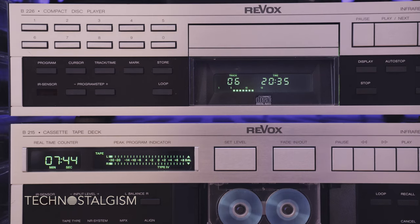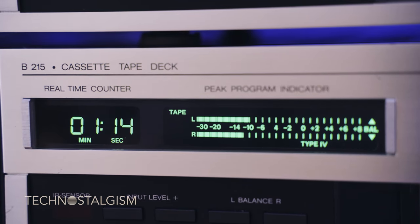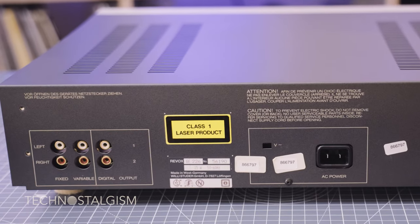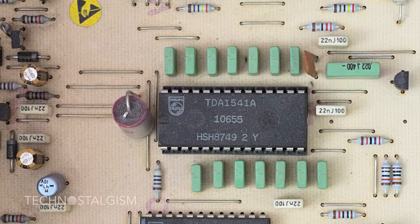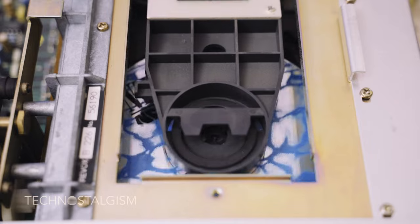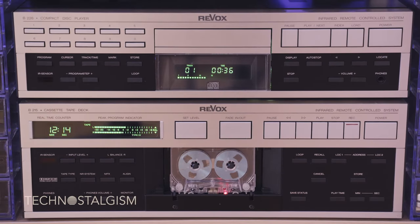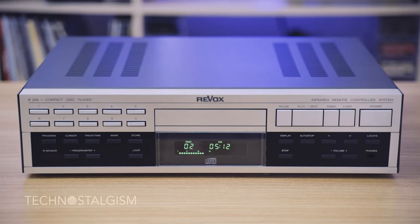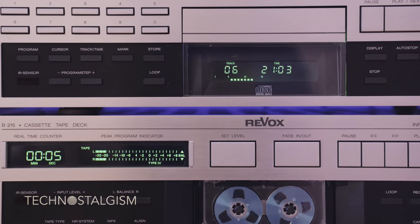And yes, there will be a video about replacing that one as well — make sure you're subscribed and hit that bell icon if you'd like to be notified when it's out. I really love this Revox CD player and use it as my main transport connected over S/PDIF coaxial. The fixed or variable analog outputs are fed by what is considered by some the best ever DAC chip — the 16-bit TDA 1541A. Make no mistake, this was at heart a professional tool. It looks like a Bauhaus estate, works like a Swiss watch, and sounds as transparent as alpine spring water. The mechanism is mostly heavy metal and the sound is heartwarmingly classical. If you want a CD player for your hi-fi today, you'd have to venture quite high up the pricing ladder for this level of build quality. These were expensive machines in the day, but a second-hand one nowadays, even with a bit of servicing, might be a steal.